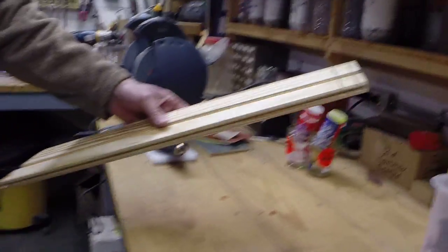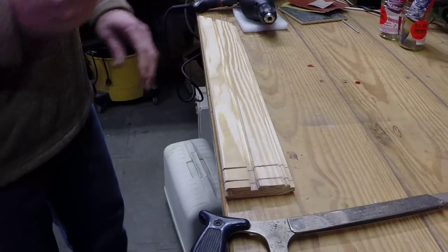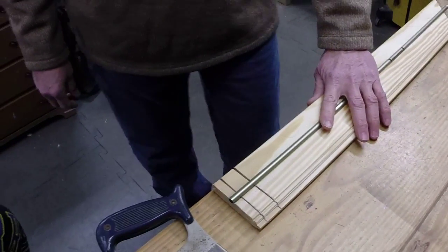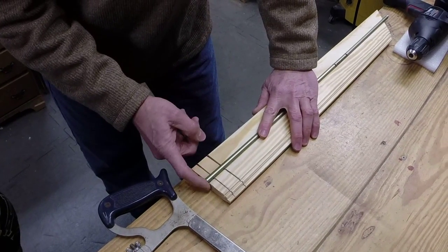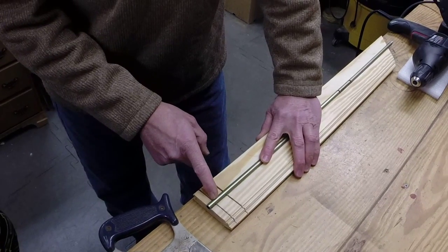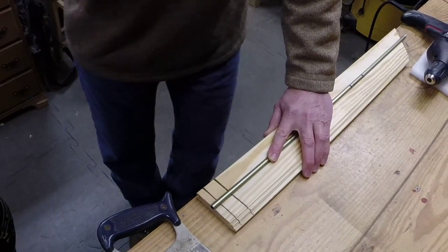If you look right here, I've simply taken a piece of tongue-and-groove board and used my table saw to make a little groove in it that's just the right size to snug that arrow shaft in. I've marked and cut two slots. The first slot, if this is flush, will be for my nock-end footing, which is approximately half an inch. And this cut is for the point-end footing, which is a little shy of two inches.